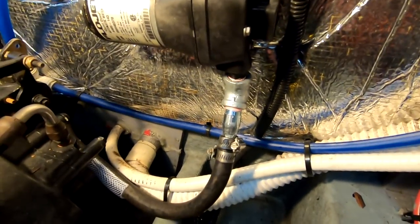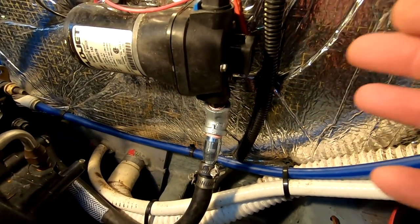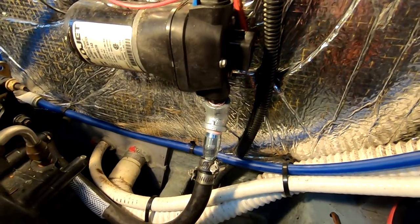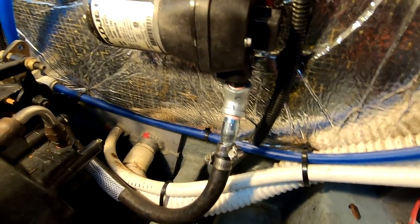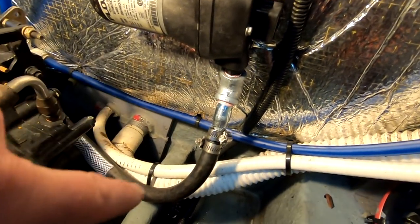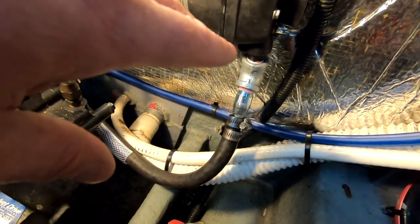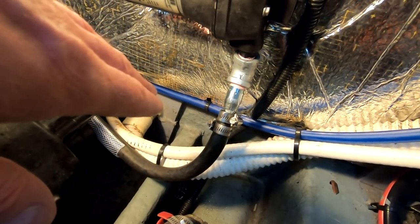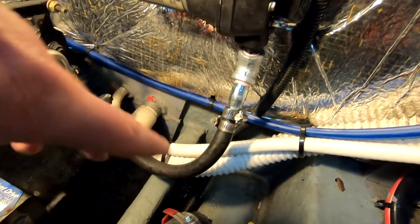There is my elegant solution and it's all good. The water's on, I've bled the system. Obviously that split was introducing air, and that's why the water was spitting so much. It's all nice now. The only thing is, because of that elbow piece and these fittings being a little longer, it's bringing the hose out this way. I chose not to cut the hose just in case it ever had to be swapped out — I didn't want to run out of hose or have to add extra hose and put another coupling in.